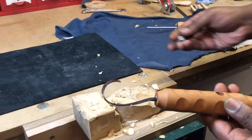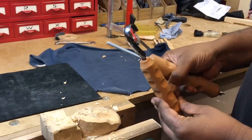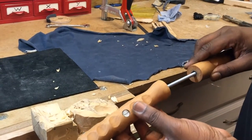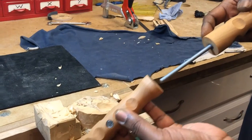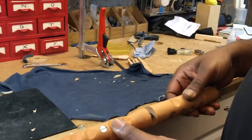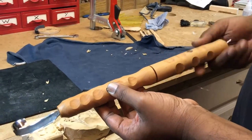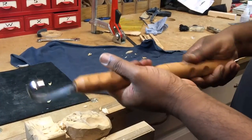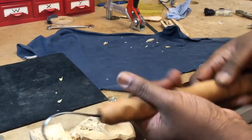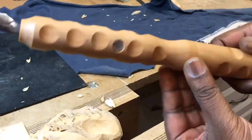And to extend it, that goes in. So this bit now can just be screwed in. And you can see that the threaded rod just goes beyond that nut. And the hole itself is pretty loose, so this is about now 6.5 mil hole. Just enlarged it just more than the threaded rod, so that it's really easy to screw in. There it goes. And you can tighten it until you're happy that the alignment is perfect. And you're nearly there now. See the grains aligned, looks pretty smooth there.